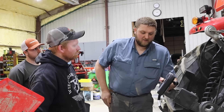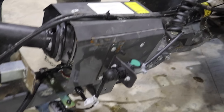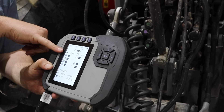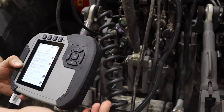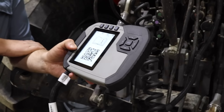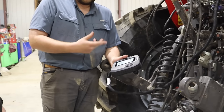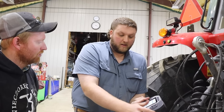This diagnostics screen is great for when you're servicing or troubleshooting an issue. As things come on and off, it'll highlight the buttons. If your fan's running, that'll highlight. If your needles are in the home position, it'll be green. So if you're having errors, you can come here and check: is my fan running the right way? Are my needles home? It also shows your speed output. The errors page takes you to our access page via QR code — that's where you find the operator's manual and installation guide. Software updates are all right there. This unit produces its own Wi-Fi; you stand here with your phone, connect, and it takes about five minutes.